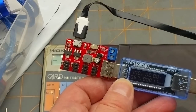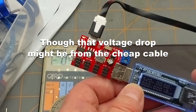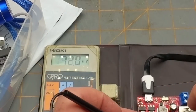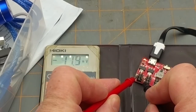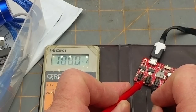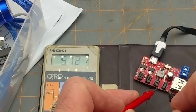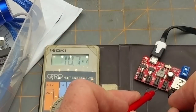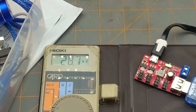This load claims to be doing one amp, or if you math it out at a full five volts it is — so that sags down a little bit. Let's check on the other voltages. Pins are a little bit bent there. That should be 1.8 and it is, pretty much. 3.3 as expected. That ought to be about 5 — yeah. And that should be the 9 or 12 — yeah, it's 9, and flick that guy and it's 11.87. Okay, so it's boosting.